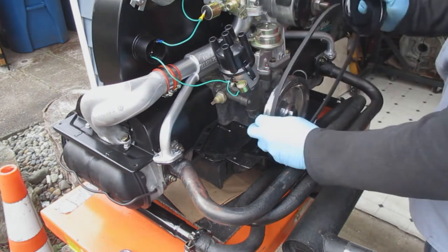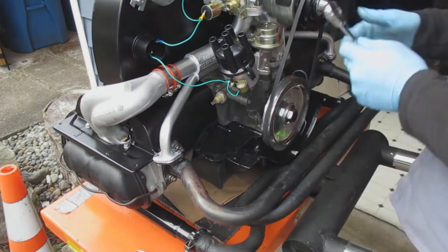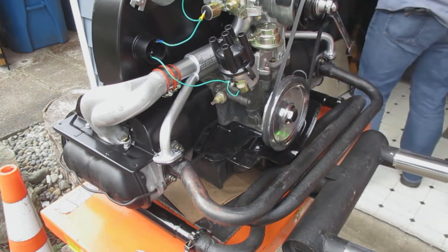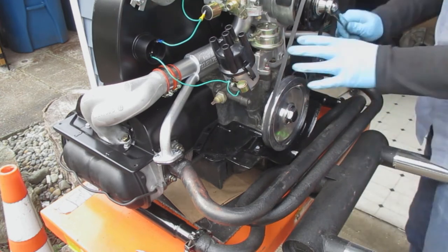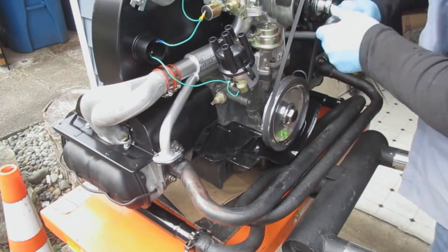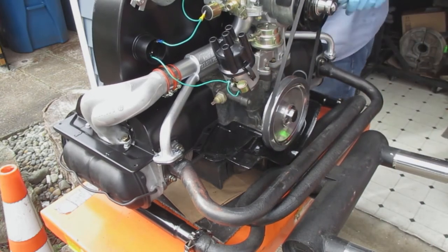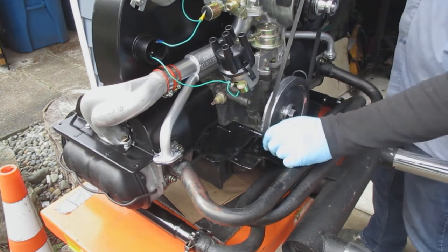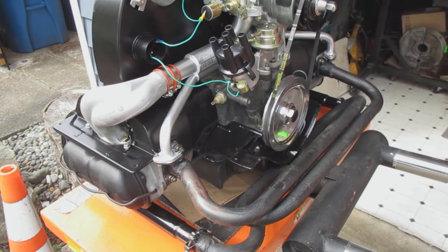Next I install the belt. I had to take it apart a couple of times to make sure I had the right number of shims for the correct belt adjustment. I normally use a 19mm socket and a standard screwdriver to tighten everything up.